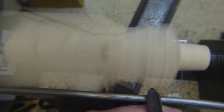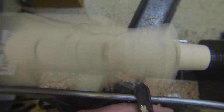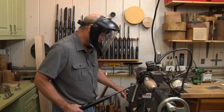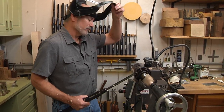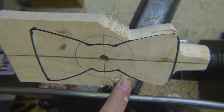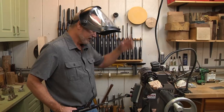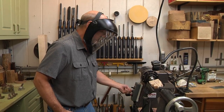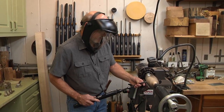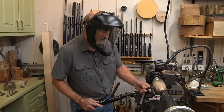This is sensitive — if you put a little too much downward pressure, the tool really cuts aggressively because you're only cutting a piece of wood like a board. Let's stop and look at it. You can see my black lines — I'm following it really well. We're going to work our way through, get the shape cut out, and then remount this. I'll come back and start sneaking up on the bead from this side.